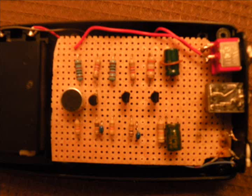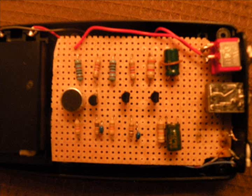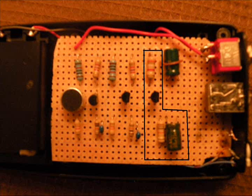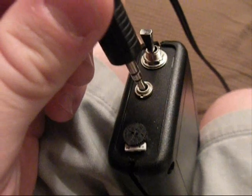The next stage is another common emitter. The resistors are the same as the first stage, so it also has a voltage gain of 20. The last stage is a common collector. It has a voltage gain of 1. Its purpose is to take the high input impedance from the common emitter and make a low output impedance. The impedance is needed to match the impedance of the headphones.